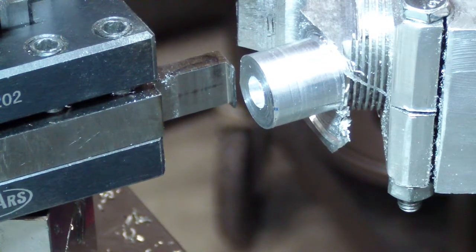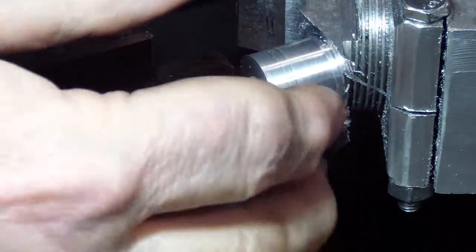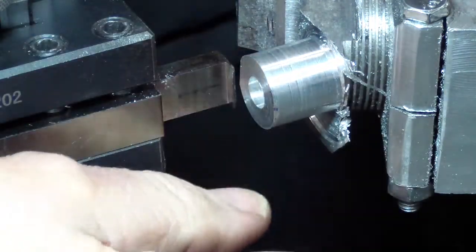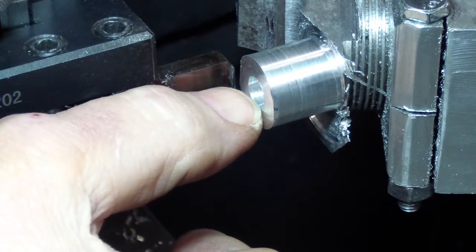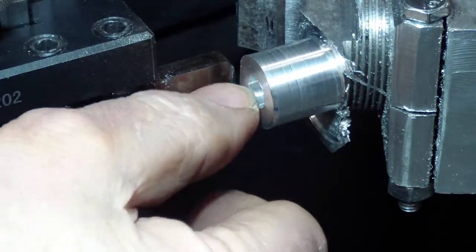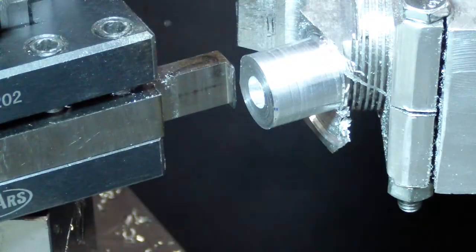Okay, we have our cylinder head. We have it rounded, the exact diameter. We got it flattened. We have the hole drilled for the valve to come into. And we've got the counterbore down to 343 thousandths. Now we're going to start putting in the fins.